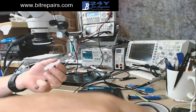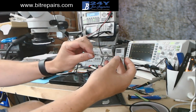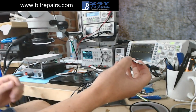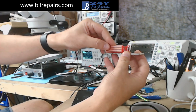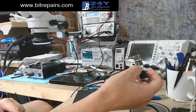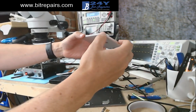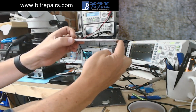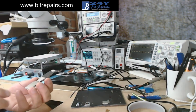So we push back with the screen - we've just got the board. Let's just have a little look sideways and see if we can see any bending to it. If you look at that, I can actually see - if I look at that with my eye - I can see a tiny amount of bending to it. There's not much, but if I just lay something next to it, you can see just a tiny bit. I can just about see a tiny little bit of a bend in that board. You look at a board that's new from factory and you look at one of these that's developed touch disease, and you always know that there's been a bend to the board generally. A slight bend on that chassis - that's what causes it.